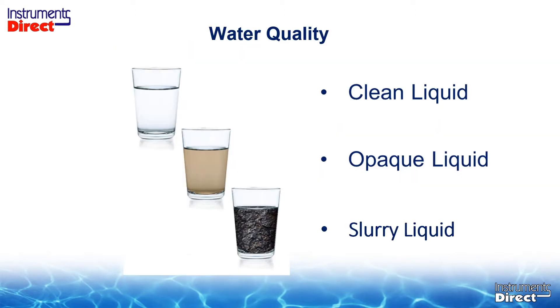The biggest mystery about suspended solids: just because a liquid is opaque has no relevance to the process suspended solids — opaqueness usually represents dissolved solids. Suspended solids required are usually 100 parts per million of suspended solids or aeration that are 30 microns or larger. That's pretty much the generic specification. If you've got lots of chunks of stuff in the process liquid, like a slurry, sludge, or dredging application, an ultrasonic Doppler is the best technology.